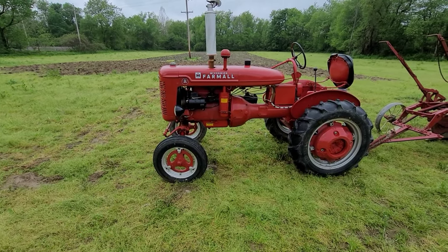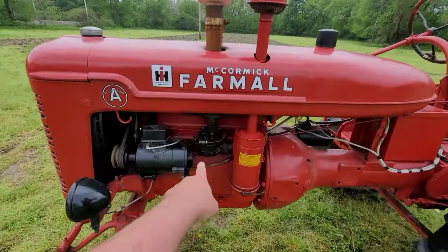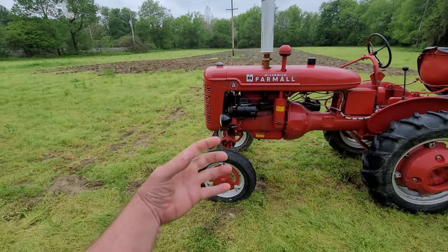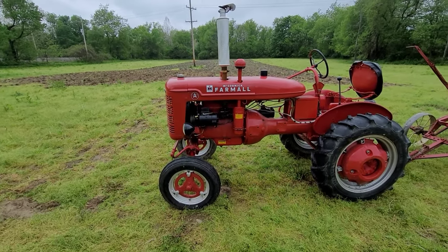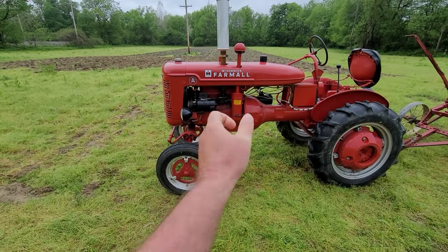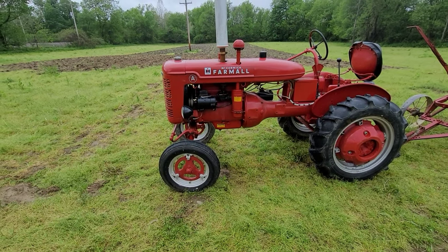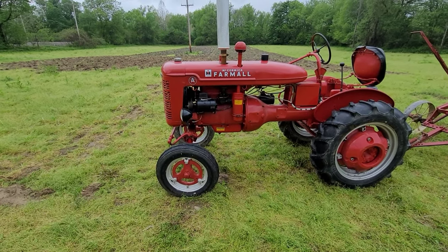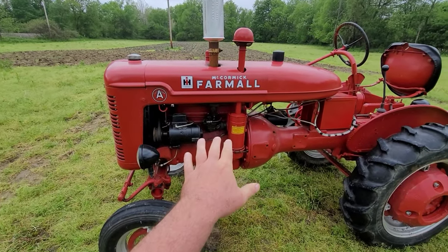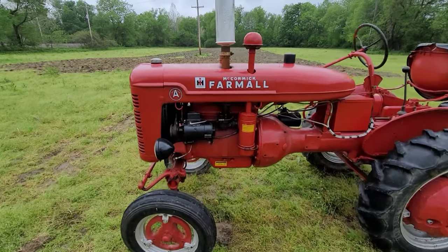And actually, when I blew air into this carb here and down at the bottom, all I used was one of those cans of electronic duster air cans. It's got a handle on it, and you just squeeze it, just blew it right in there. And then I blew carb cleaner in the top hole there, let that settle for a while, and blew air in it again. And then a couple light taps.